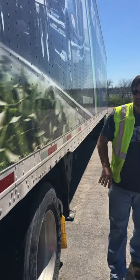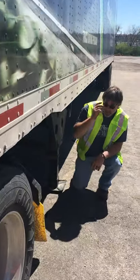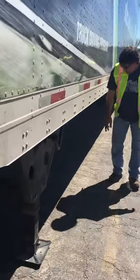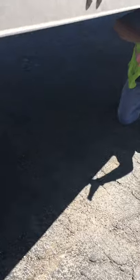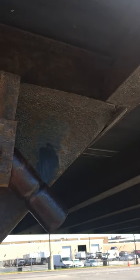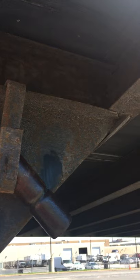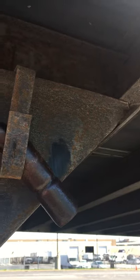Your frame itself — I want to make sure there's no damage to it. Now if you look under here, you can kind of see how the trailer's all put together. You got your frame, and you got all these cross members that go all the way down the length of the trailer, from your apron all the way to the very back. You want to make sure your framing cross members aren't missing, they're not broken, they're not damaged, and all these rivets that hold these cross members in place are not missing. Our floor underneath here — the actual floor of the trailer — it's made out of wood. You want to make sure there's no planks missing, no holes, no damage.